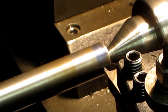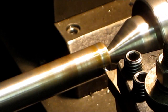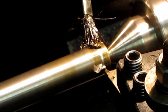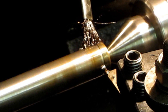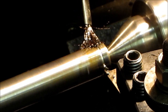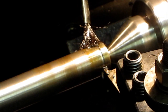An actual dial will show the diameter that is reducing — for the amount of lines going in, each line is a thousandth on this, so I'll be going down to 25 on there once I set it and touch off. Just touch — got it set at zero. We just keep a little cutting fluid in the groove as we go, feed it in slowly. There's 10... 15... 20... 25.